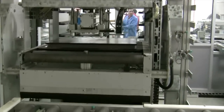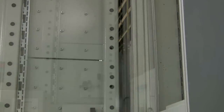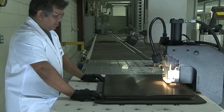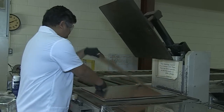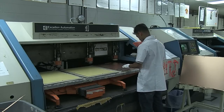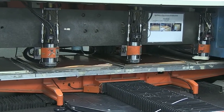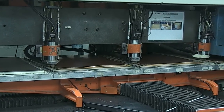The system automatically loads stacks on the loader and loads them into the bonding press. This press uses heated press plates and pressure to bond the layers of the PCB together. Once the cycle is completed, the system unloads the press and carefully rolls the heavy stacks. The layup operator destacks and removes the top plate, unloads each of the panels from the stack, removing the aluminum press plates used to ensure a smooth copper finish. During bonding, excess resin from the prepreg is squeezed to the edge of the panel outside of the image area. This excess is now cut off on a computer-controlled profiling machine. The operator loads the panel onto the bed of the machine and selects the correct program with the x-y coordinates of the path for the cutter to follow. The cutter mills out the final profile for the production panel.